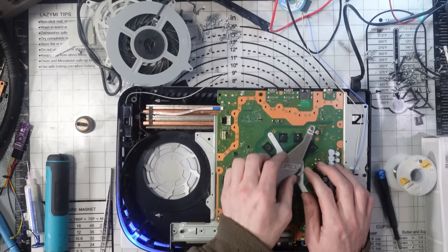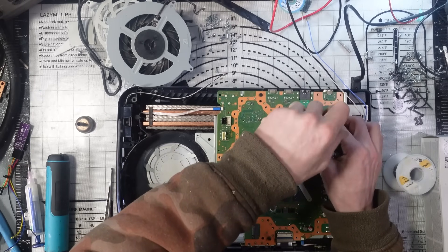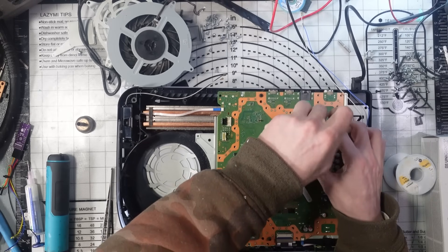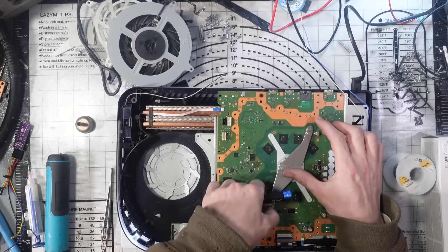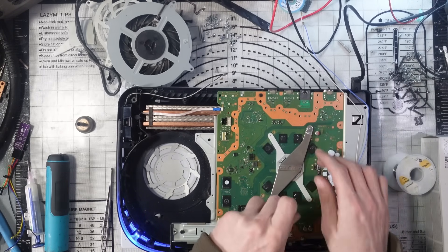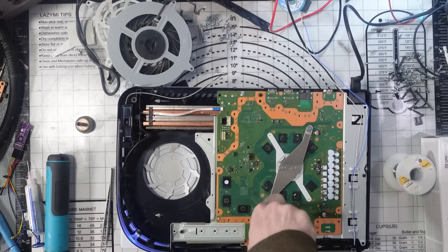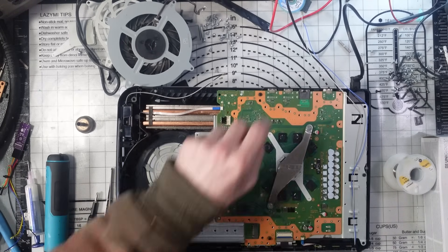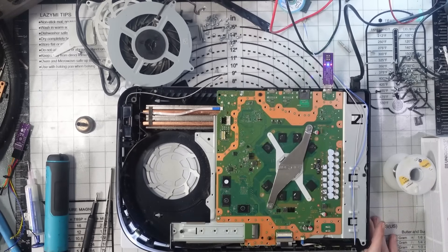She's turning on! The thing is we had this yesterday as well and then as soon as the board cooled down it wouldn't turn on again. First of all, let's make sure it gets to a white light — and yes, we do get to a white light, good. Now I need to make sure it displays; I can do that with the HDMI tester. Then strip it all down, clean it out, put it back together, and test it again to make sure it stays on. Triple beep of success right there!